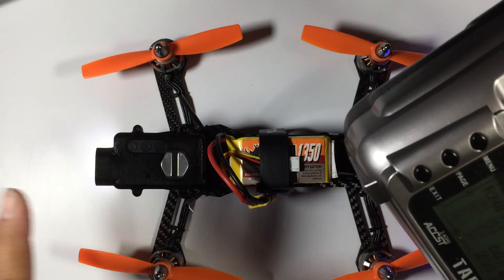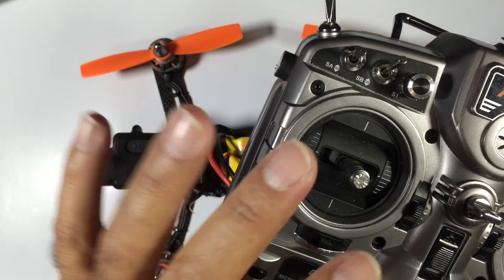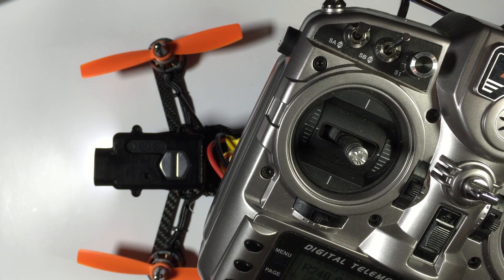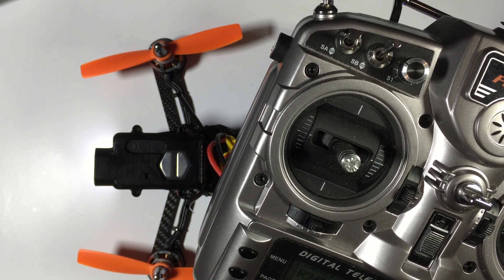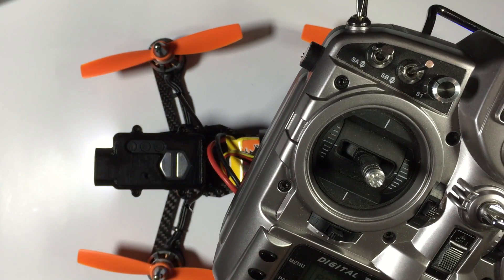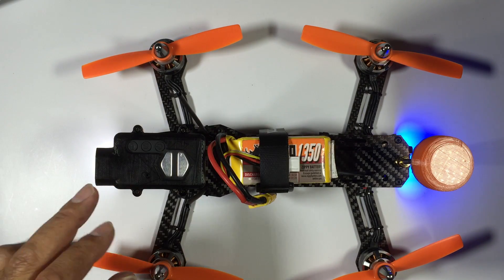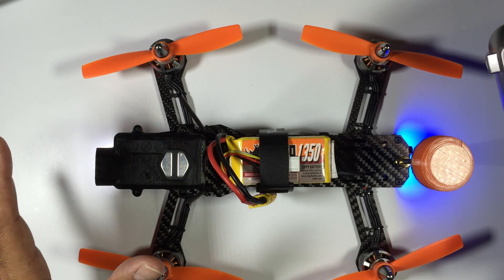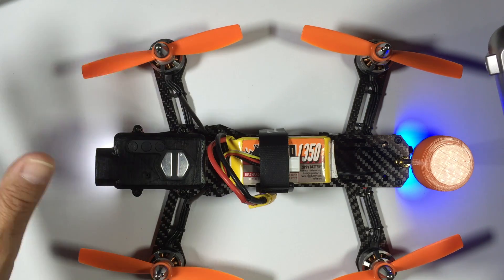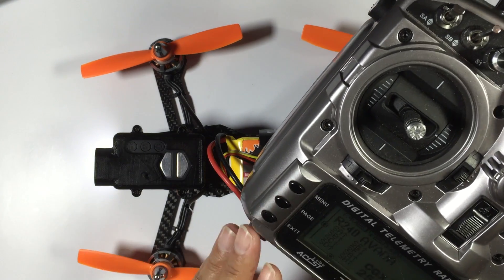One of the cool functions is I've got two switches here. One is my RSSI switch — what it does is the radio gives me an RSSI callout every five seconds. You can set it to three seconds, five seconds, or whatever you want. That's really handy when you're cruising around and you might be exploring a certain area to see how your signal is, especially if you're not running an OSD and you need some telemetry on your video signal strength. I use that quite often when I'm exploring somewhere new.